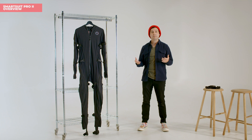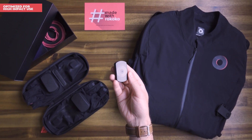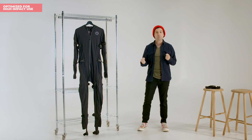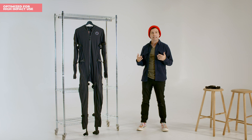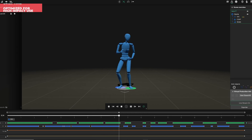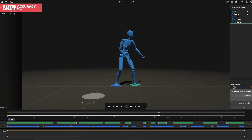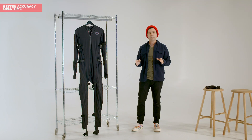So how have we actually improved the motion tracking technology within the suit? Starting with the sensors, we've upgraded them from 8 Gs to be able to read up to 16 Gs. An example would be hitting a punching bag — now the suit will be able to read your motion capture data much more accurately throughout that entire action. Advancements in inertial technology mean that we've been able to significantly reduce the amount of drift compared to the original suit, which is especially important with the rise of V-tubing and digital live performances, where you may need to be in the suit for an extended period of time.